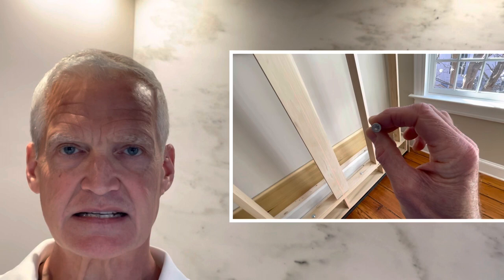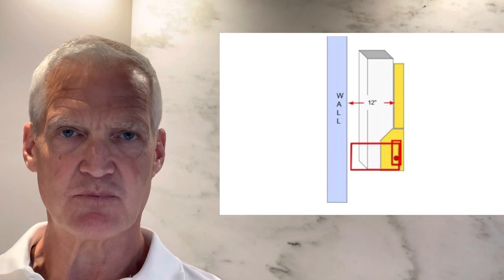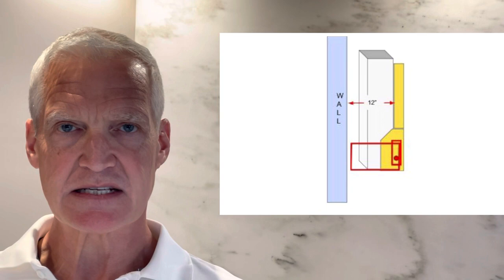E, the distance from the wall to the top of the bed frame when folded up is an important dimension. I chose 12 inches, which gave me 2 inches of clearance plus 10 inches for the mattress before reaching the top of the bed frame.